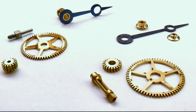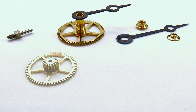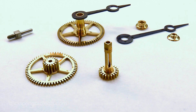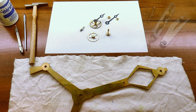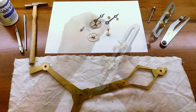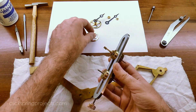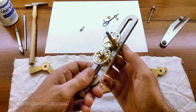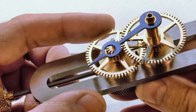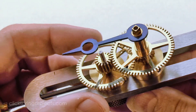That completes most of the machining, and some of the parts can now be pressed into place on their respective seatings. Next I need to depth the position of the intermediate wheel stud so that it can be fitted to the front plate. As for the wheels of the going train, I'm using the depthing tool to do the job. The fine adjustment screw moves the wheels closer together until I can see and feel the smoothest meshing of the teeth.